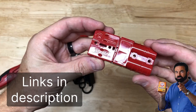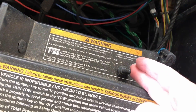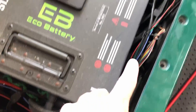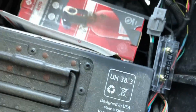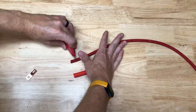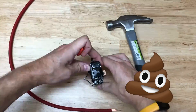Purchasing through my links helps support the channel at no additional cost to you. We start by flipping the cart into tow mode and turning off the battery. Let's talk about this six gauge wire — it's a bit pricey but you want to make sure you measure and get enough. If you're short, you'll have to put your inverter in an awkward place and you might not be able to reach the power cable of the fridge. The worst part about this build was the horrendous smell from this six gauge wire.